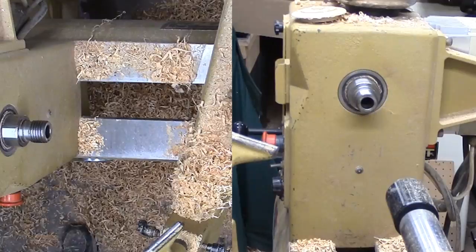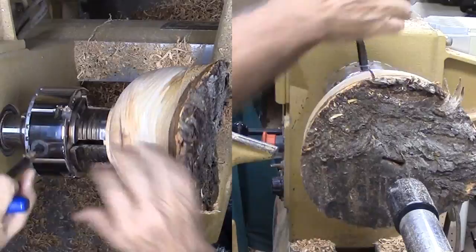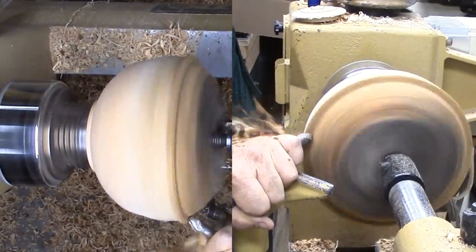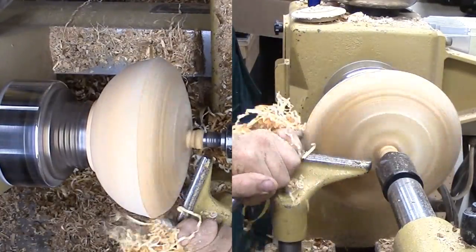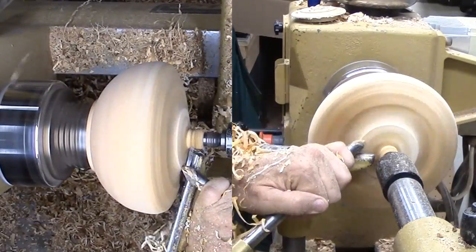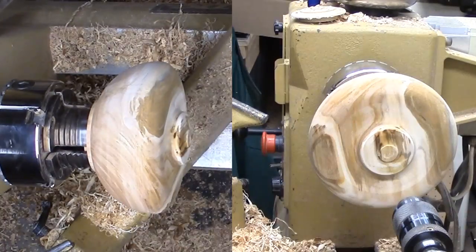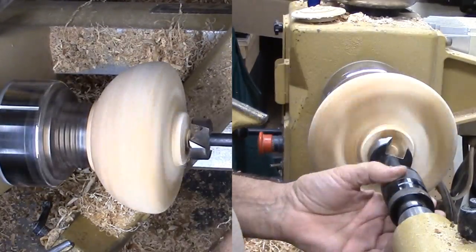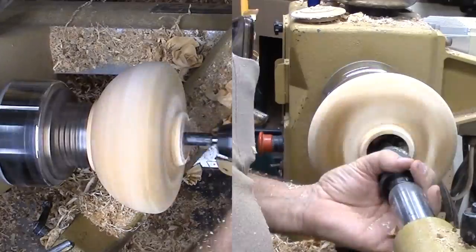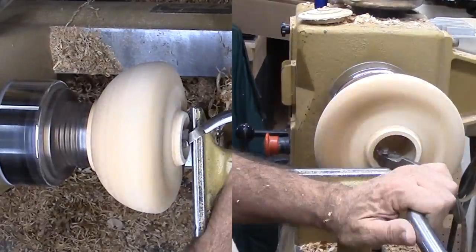This cherry is great turning wood. Now with the bowl reversed into my chuck using the tenon I cut just a bit earlier, I'm choosing a fairly flat top to emphasize the fins. I'm still using my gouge edge for wood removal and for refining the shape. I'm going to drill the first hole into the interior with a Forstner bit. This is not difficult since the hole is going into cross grain and the cherry is still soft from being wet. Now to hollow out the interior.